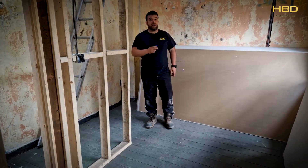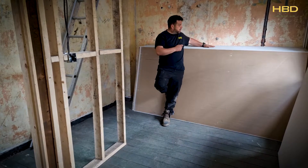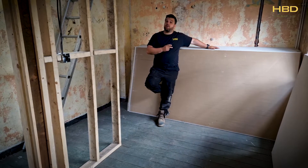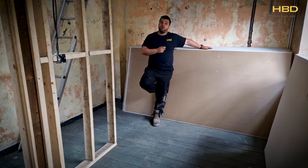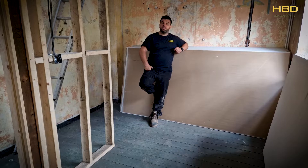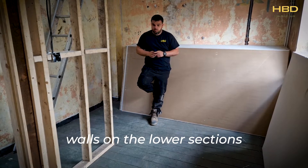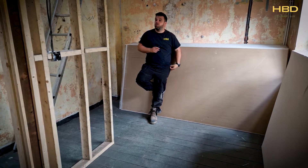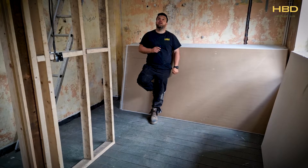In this particular house, we are re-skimming the whole house. There are a number of plasterboards behind us — these are going up in the loft. The loft has never had plasterboards in it. It's getting some insulation between the membrane and the plasterboard. To form part of building regulations it will have to be an insulated plasterboard. These are going on the walls on the lower sections, and they're overboarding the ceilings in every single room in this house, as they're all board-cracked and in need of repair.